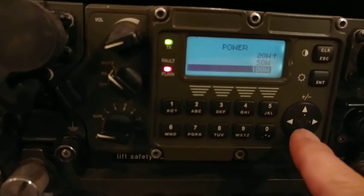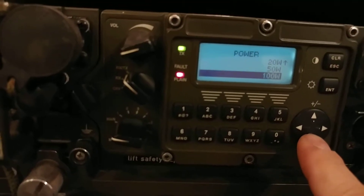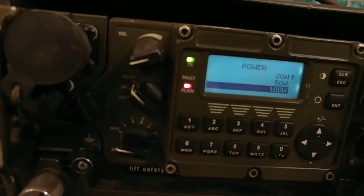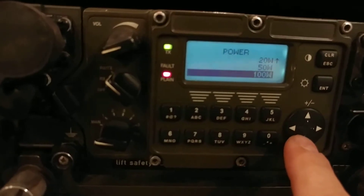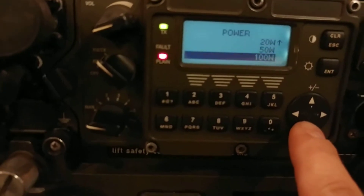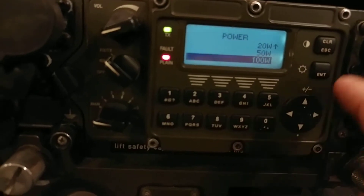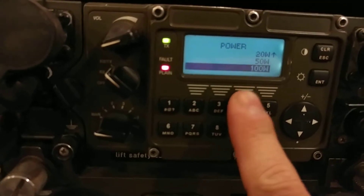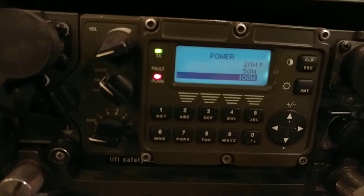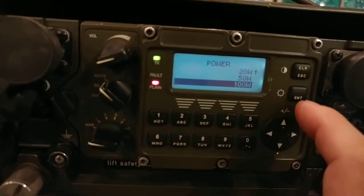There's no option for 150 watts now. The reason is that on CW, this amplifier only allows 100 watts. My guess is RTTY will also be limited to 100 watts — these continuous modes are probably limited to 100 watts average, while sideband can go to 150 watts PEP. That's my interpretation — 100 watt average, 150 watt peak envelope power.